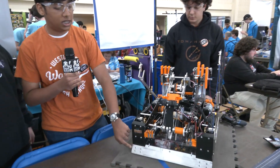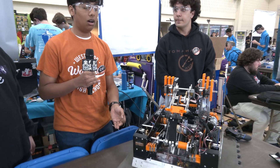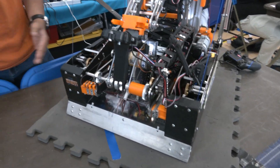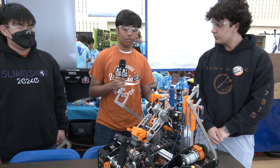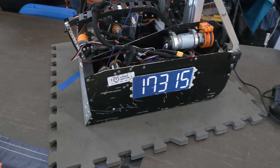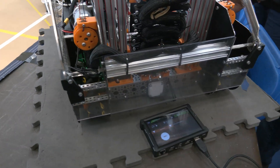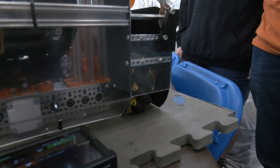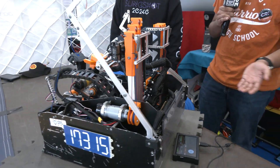We even have a wedge in front to protect the robot from impact and for better contesting at the submersible — we can pick samples from the sub while contesting a specimen bot. For the drivetrain, we used 1/16th-inch 7075 aluminum. We chose this because it was thin and we could keep a solid plate of aluminum while still keeping it as light as pocketed 1/8th-inch. We did this because the robot was already fairly wide and we didn't want to make it even wider to fit within regulation.